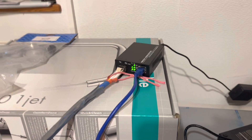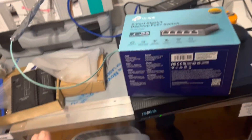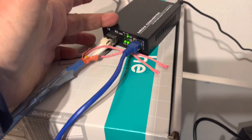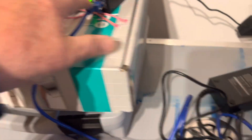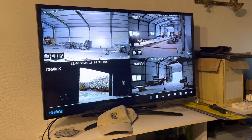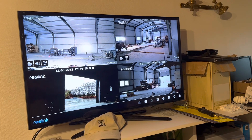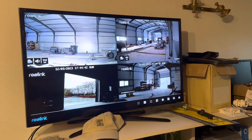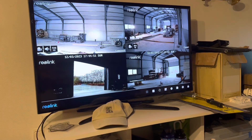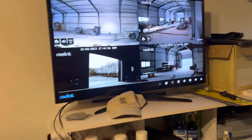So we are in the house. I've just thrown this together to check it's going to work. That's my Reolink player - you connect the other end of your media converter: the fiber optic green cable goes into the media converter, which spouts it out to an RJ45 that then takes the information to the back of the Reolink DVR - digital video recorder. When I plug in a camera, up they come on screen, and I just cannot believe the clarity of those cameras. It's dark in there and this is what it's picking up.